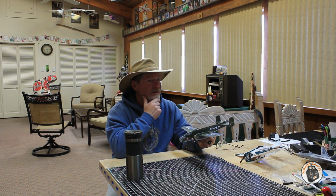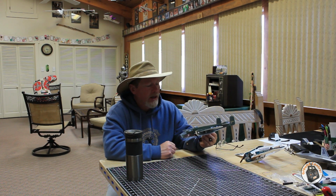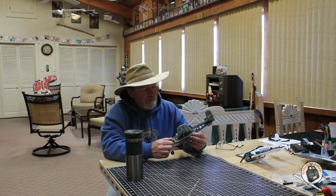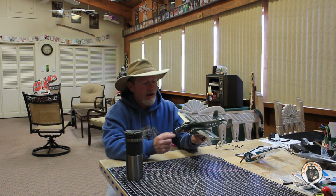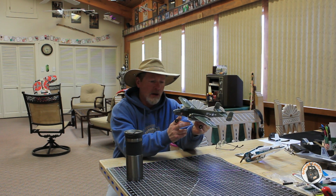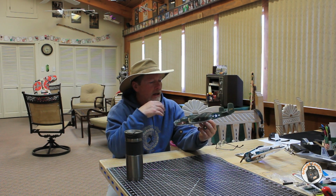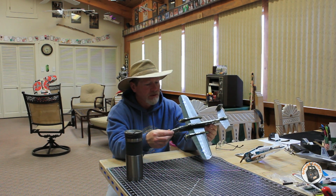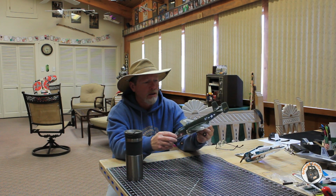If you saw the third take, I think it was the third take, it had plenty of power to cruise around, but it still definitely didn't have the power to do any aerobatics. And I still had a tail heavy condition. Now I basically taped the battery underneath it, with the end of the battery stuck right up against the front strut. Being that I want more power on this airframe, and I really like the airframe, I think it's a really good airframe, and with the right amount of power and getting the CG correct on it.